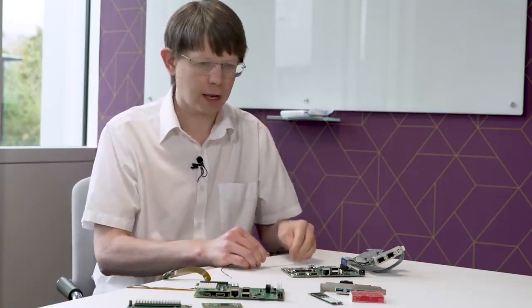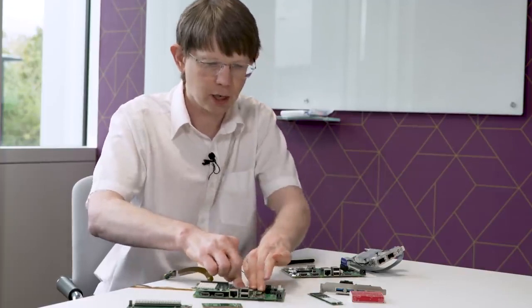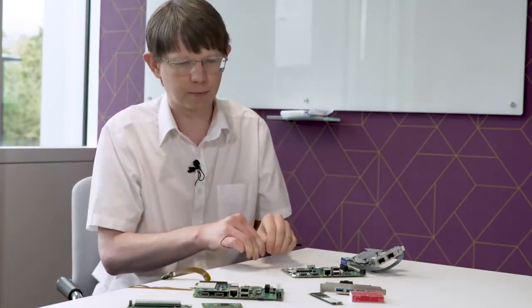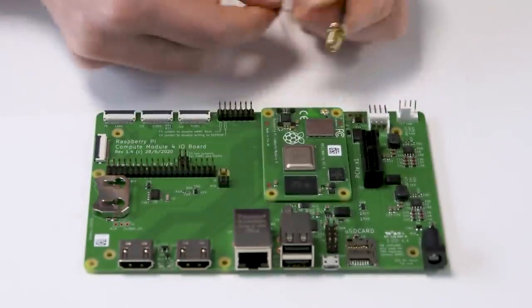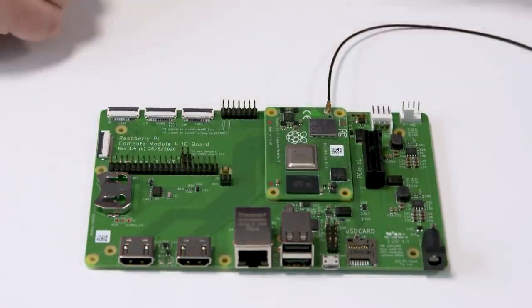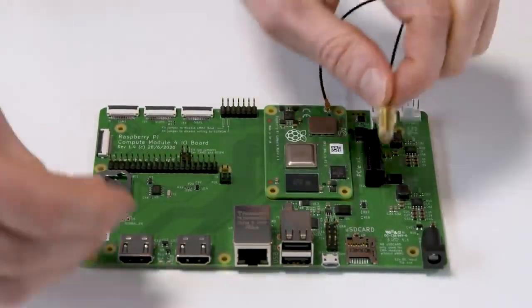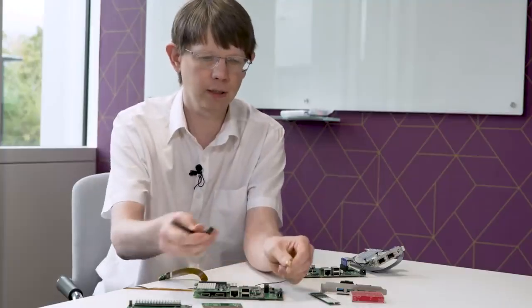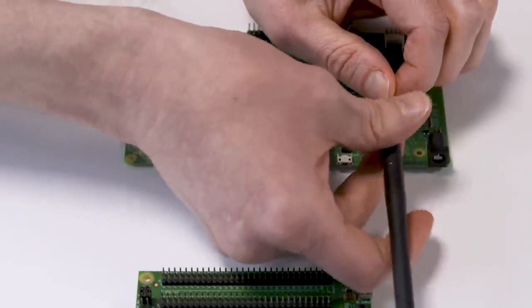We talked a bit about wireless and external antennas. That brings us probably to the third piece. Yes. So if you've put this in a nice metal case with your nice shiny new CM4, you may well find that the onboard antenna won't escape the case. So what we've got here is an antenna kit. It comes with a cable that you can clip in to the UFL connector, a standard bulkhead mount SMA socket that you can put on the edge of your case wherever is convenient to you, and then a little SMA antenna that you can screw in and have a little radio interface.